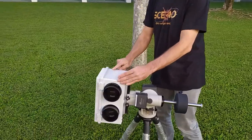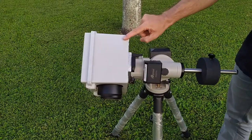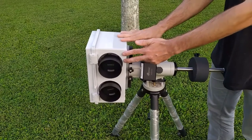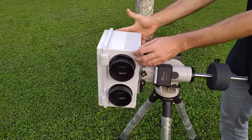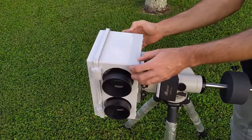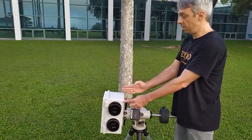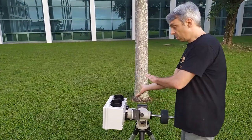To check that, I rotate the head 90 degrees. Now we're testing the other axis — I let it go and you can see it wants to rotate that way. That means there's too much mass in the front, not enough in the back. We don't have a screw to change that; we can't slide it in this direction. So what we're going to need to do is add counterweights in the back — open the box and add weights until it's balanced. When done, in both directions it's not going to go forward, backward, or side to side.